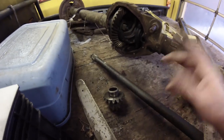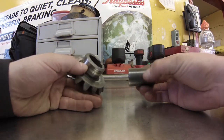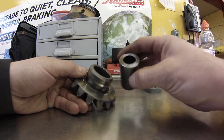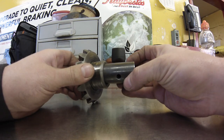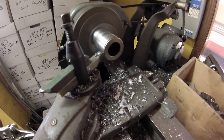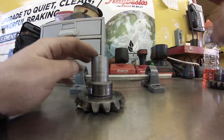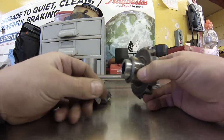I'll show you how to build these little gearboxes and then from there we should get our drive system going. This will be the driven gear — that's the larger of the two gears. I need to reduce this down to three-quarter inch for the shaft that's going to drive the back via a chain. I found this bushing from Princess Auto but it doesn't quite fit, so I'm going to turn it down on the lathe to slide into there. Once the bushings are turned down, I pressed them in and I'm going to weld along here and there — that's going to give me my driven gear.